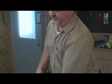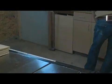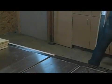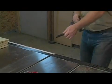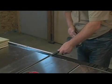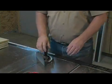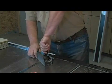We will cut the side pieces and front piece down to 13 inches wide. To do so, we must reinstall our miter gauge by removing the rip fence. This time, however, the miter fence must be turned to 90 degrees.